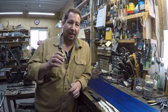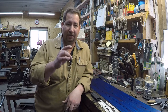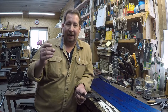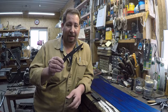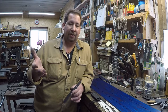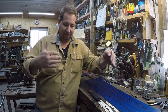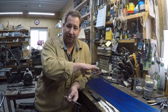I think that if you start with a large piece of steel, 1 inch round or larger, and you forge that steel out under controlled temperatures, controlled timing, and in a methodical manner, the number of heat cycles that you put that steel through until it gets to be a blade has a tendency to refine the grain and sort of undo the damage that the mill caused when they rolled it out. So basically the mill gets a block of steel from the foundry, and then they will roll that steel out to get sheet stock.